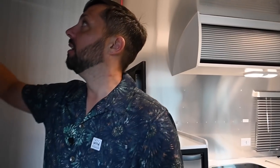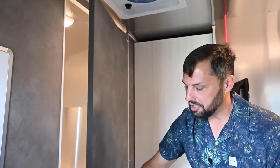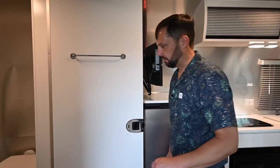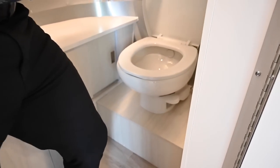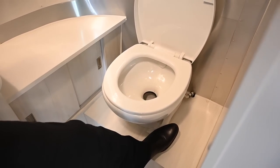Let's head to the bathroom. What's nice is there's a gap at the top so you can use the fan here to discharge stale air or steam. It has a flush handle so you don't get caught up on it. You can leave the door open to really open up the floor plan — you can see from front to back. In here we have a porcelain toilet. That box the toilet sits on is the black tank enclosure. It's a foot-flush toilet — you put your foot on the pedal, press a little to fill the bowl, and all the way down to flush. You control how much water you use per flush.